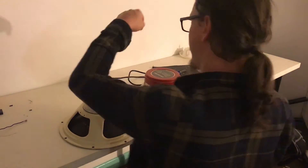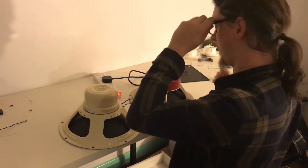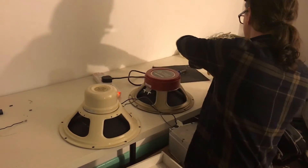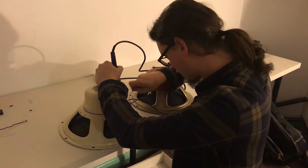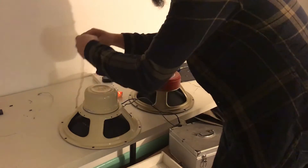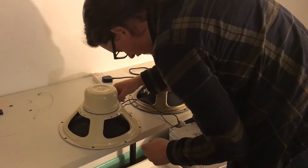It's time to add the cables — as you can see I've already put them through the loop holes and twisted them so they're not going anywhere as I solder. I'll wire it in as an 8-ohm speaker and then parallel the other 8-ohm off it so it becomes 4 — not 16. I already worked this out and already said it in the video, I'm just losing my mind — it's Friday! All of these wires are pre-tinned by the way, so I don't need to do it twice.